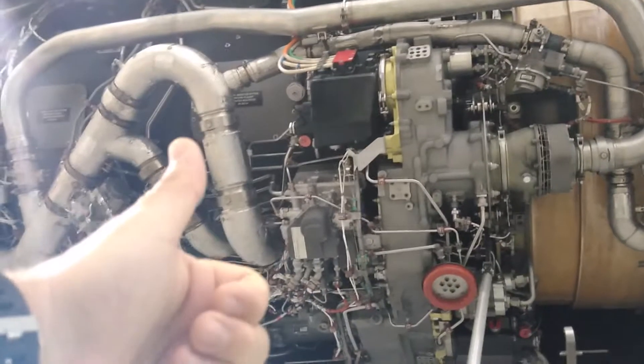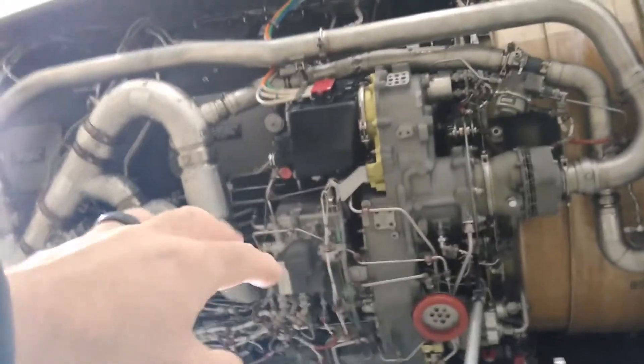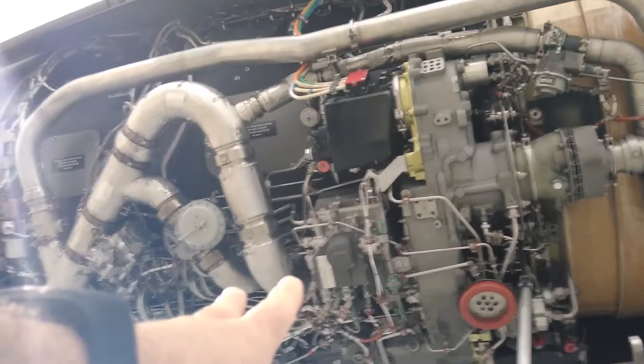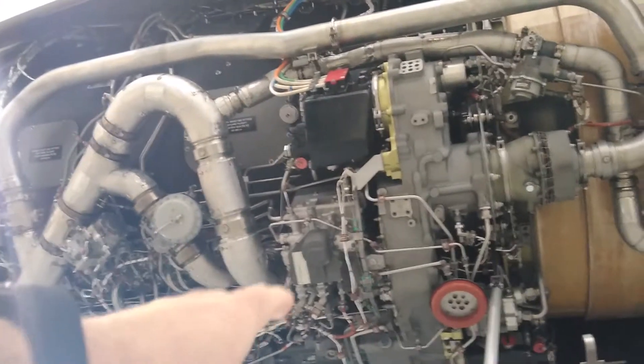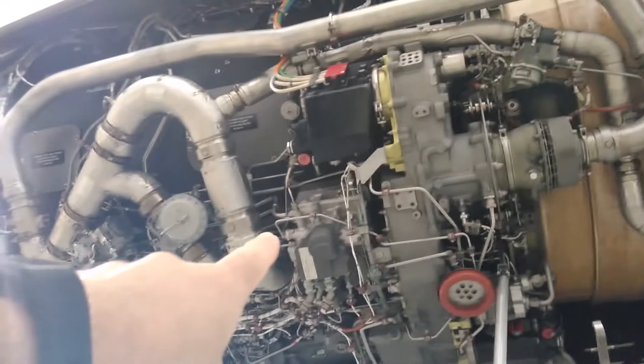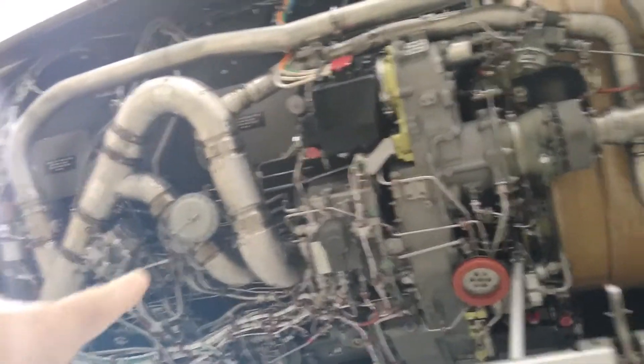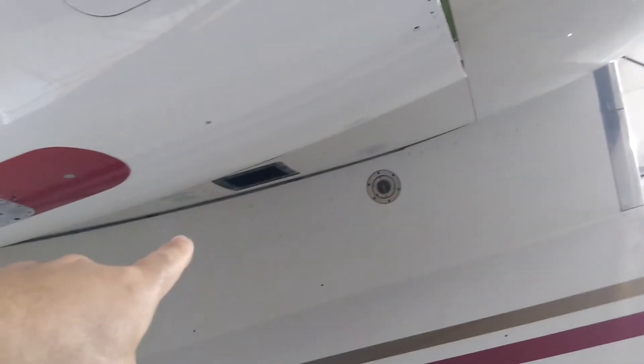One of those functions is air conditioning, and another is heating up the leading edges. The hot air comes from the compressor — when you compress air it heats up, and the air leaving here is pretty toasty. It goes down these ducts through the pylons into the fuselage.